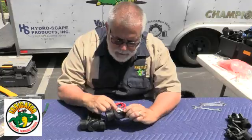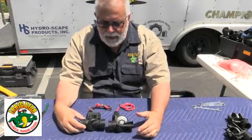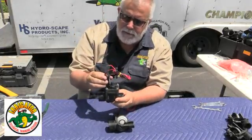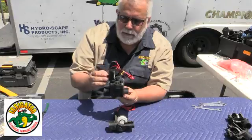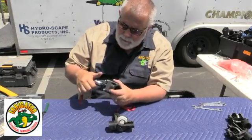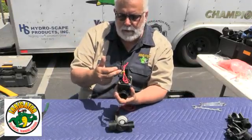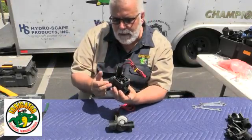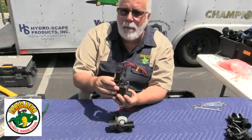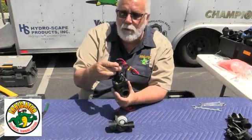The diaphragm is molded and double-beaded — very good. Hunter makes some of the best products in the field today. Very well known company, excellent engineers, they make great products. On this solenoid, you can see it says open or closed. All you've got to do is turn it and the water internally bleeds inside, opening the valve and the water comes down. It does not fill up the valve box full of water, so you don't have to worry about it. This is an internal bleed solenoid.